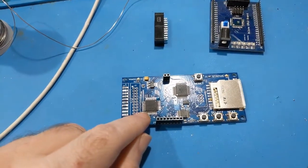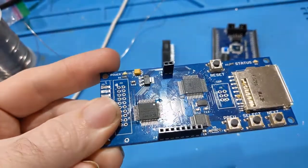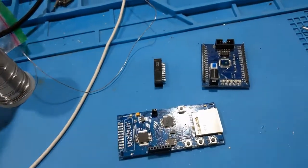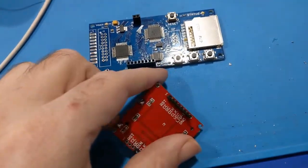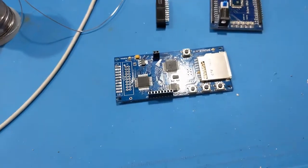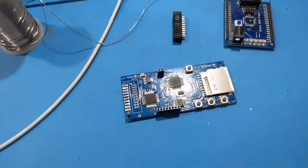And say we do a flash on the CPLD first. I'm going to get the firmware put on the SD card. I'm going to get the screen put on here, which I did fix. I soldered it down on all 4 tabs. So yeah, let's get the screen on here. Well, I can't do that yet. I gotta get the power connected. So get the power connected. Let's get the screen on here and get the flash on the SD card and make sure we can get the CPLD programmed and it doesn't throw an error.